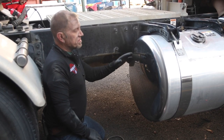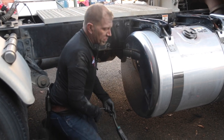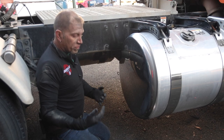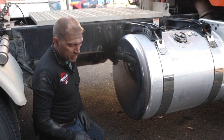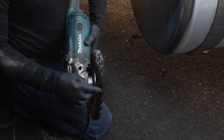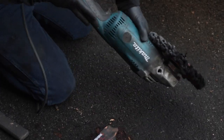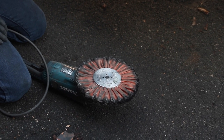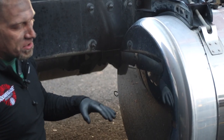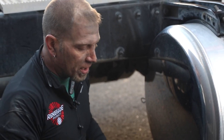You just saw how we did our back cut and the initial first diagonal cut going up. One of the things we've touched on throughout our video series is raking and loading of compound — knowing when to rake. When you've got this build-up of metal and you start seeing that sheen on your buff, that's when it's time to rake. That's just metal build-up; if you try to load over top of that, your compound is going to go away — it's metal-to-metal contact and you're not doing anything.